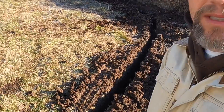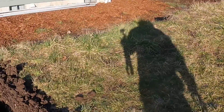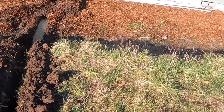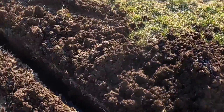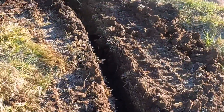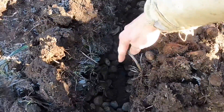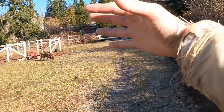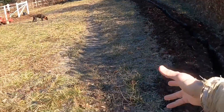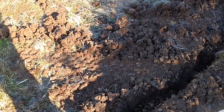As far as code goes, it doesn't necessarily have to be that deep either. As you can see, I do have some water. I went ahead and dug the trench yesterday with a trencher. The reason water's coming from up here is I've got a curtain drain. I had to cross my curtain drain, which is right down here bedded in some gravel — it gathers all the spring water and directs it through. My conduit's going to go over top of it; I'm going to try to stay above that pipe so water can still flow.